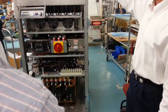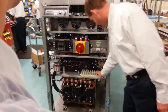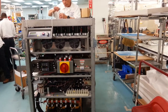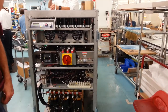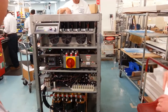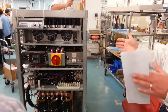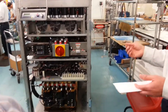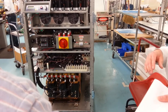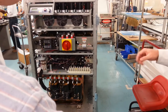A little older module — everything's accessible from the top and front of the unit. Main input wires here. See, this one has a maintenance bypass switch on it. This is double conversion. Input nominal is 208V, and it has a large input window — plus 10, minus 30 percent rated input voltage. And if it gets outside of that tolerance, then you'll go into battery backup.